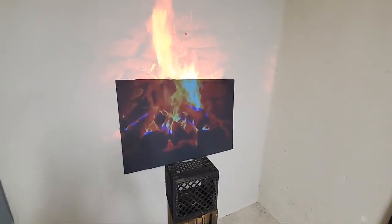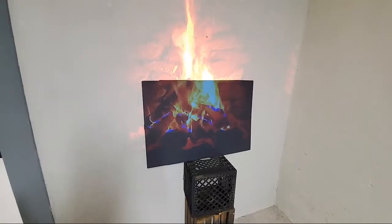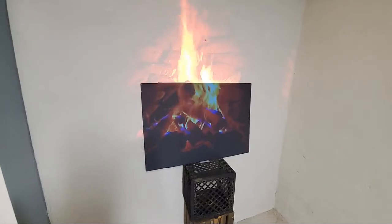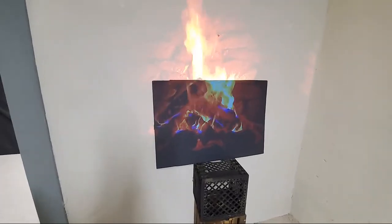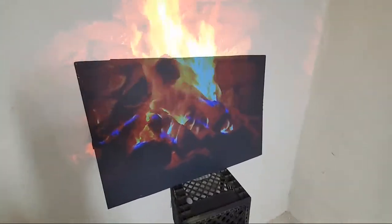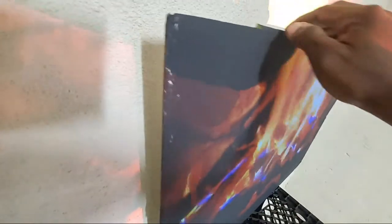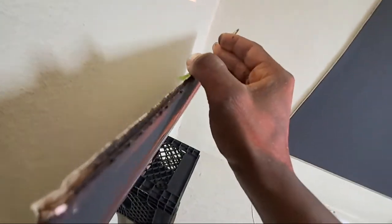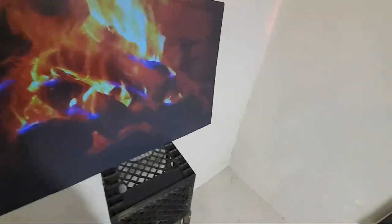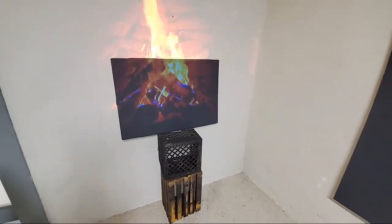And that's a 4,300 lumen projector standing behind me. I see this a lot in churches. I see churches with really high-end projectors, 10,000 lumen projectors, and they think because they have a white screen with it, they've got enough lumens to pull it up. And like I keep telling them, it's not the lumens, it's the contrast. And this is a United States shipping postal box and frog tape. That's my screen. So you can build a screen out of anything you want. Shipping boxes. That's my screen.